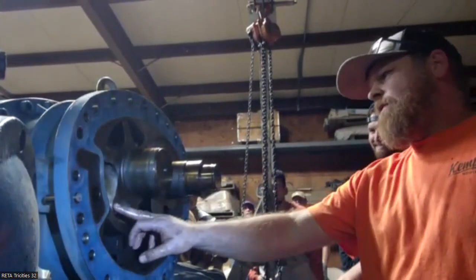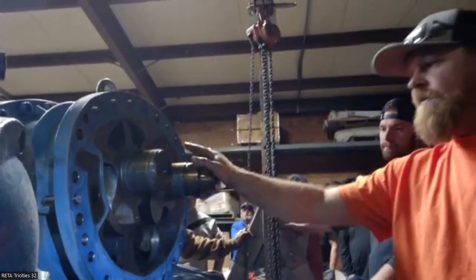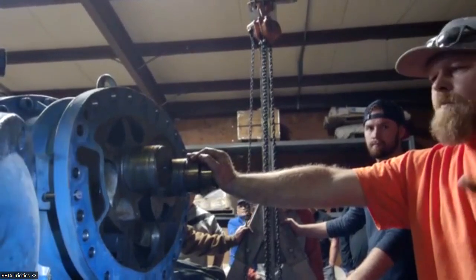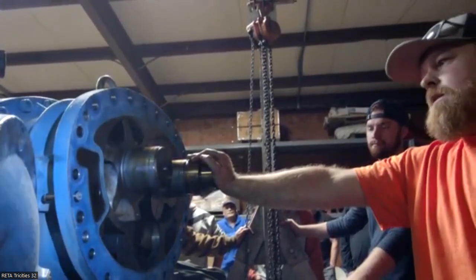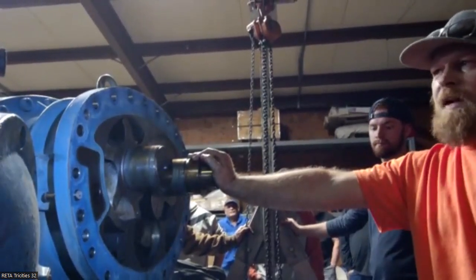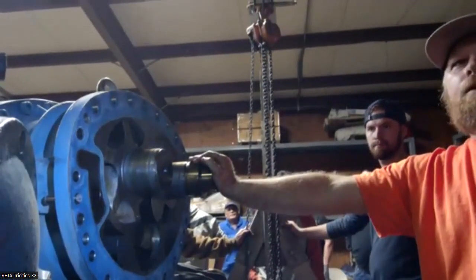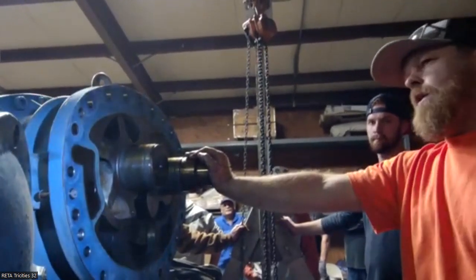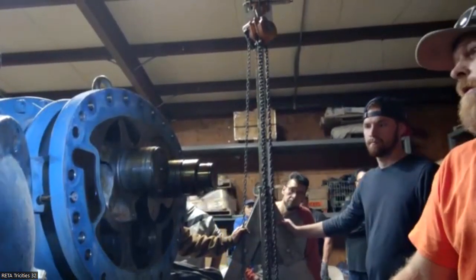The ends of these rotors have these balance marks, these holes on the end, these are for balancing the rotors. They come from the factory balanced. Any compressor we take apart, we balance the rotors. That affects the longevity of the thrust bearings. And you'd be surprised, even if this was balanced at the factory, it might have just hit their spec. But once we have them, we take them in and have them rebalanced. They take it down as far as they can go without drilling the hole too far and having to start over, or adjust the weight one way versus the other.